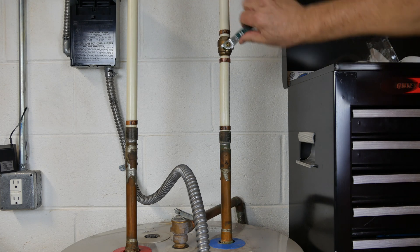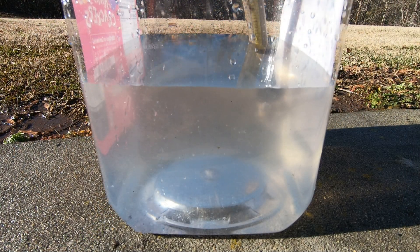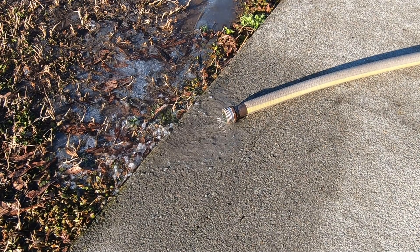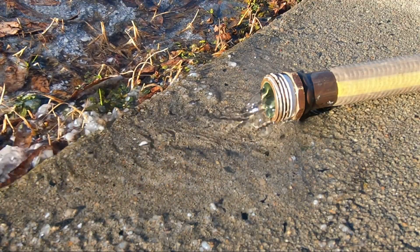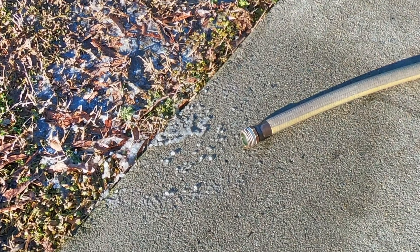When finished, leave the water turned off for now. I want to show you exactly what was being flushed out of my tank by using this clear plastic container. Notice the thousands of white smelly particles as well as occasional black sediment. When my wife built this house, she said the well diggers hit an artesian well, which is great for water volume but horrible for minerals and deposits which accumulate inside the tank — I'm thinking some of this is calcium. So much has gathered in the yard it looks like sleet. As I slow down the action, you can see large pellets appearing. I ended up having to back flush five times to get clear, clean smelling water. If any of my viewing audience recognizes what this is, please leave a comment. Regardless, now you can see the reason most folks need to flush their tank annually.